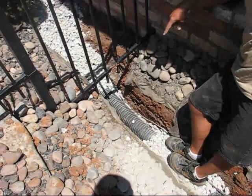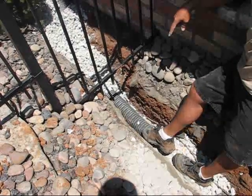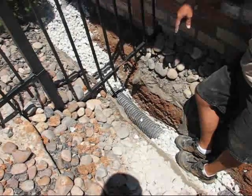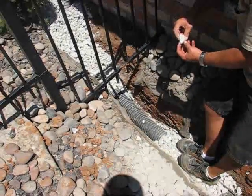This is the difference between the French drains I install and the ones that I replace, which will last a couple of years. We have a minimum of two inches of gravel that we put all around the pipe. We use an inch and a half clean rock with no small screening material in it.